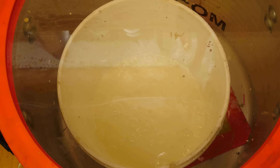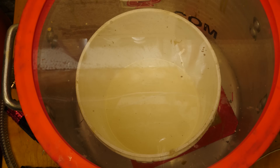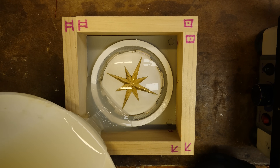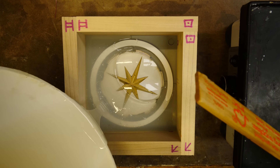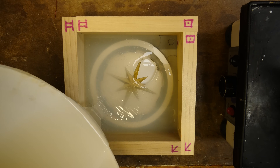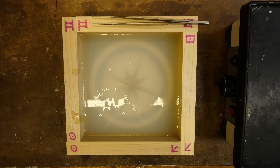A note about this 5110 silicone: it's way softer than I would normally use and not really appropriate for this kind of molding. Once the silicone has been completely degassed and there are no more bubbles coming up, you can pour it into your mold box. I have a vibration table on the right-hand side constantly vibrating the bubbles to the surface — those bubbles come just from pouring it out of the bucket into the mold. The vibration really gets you a nice, clean part.